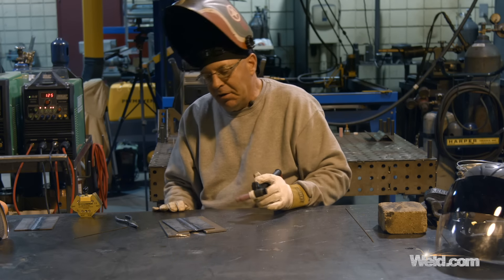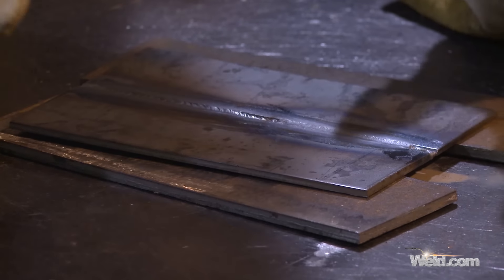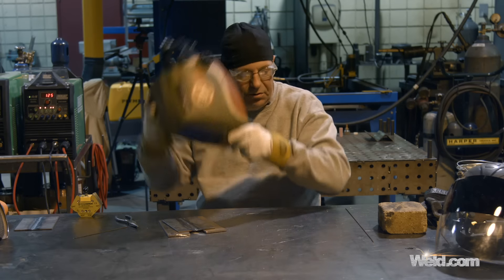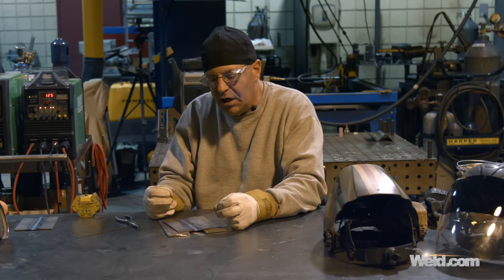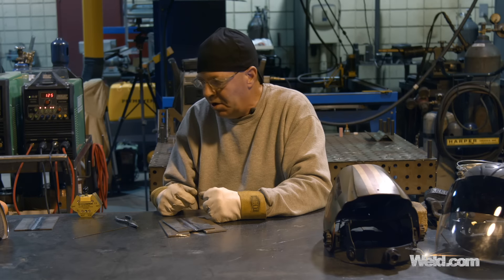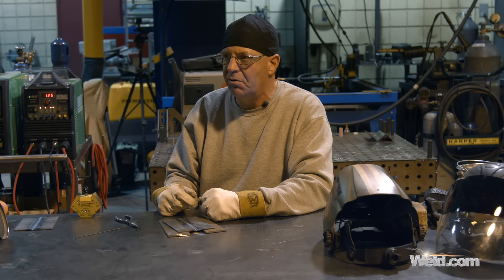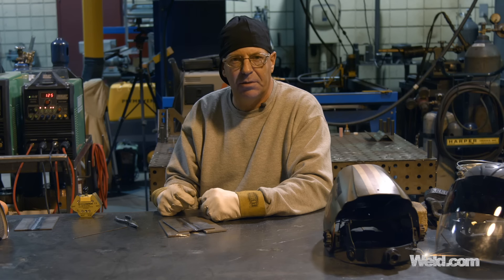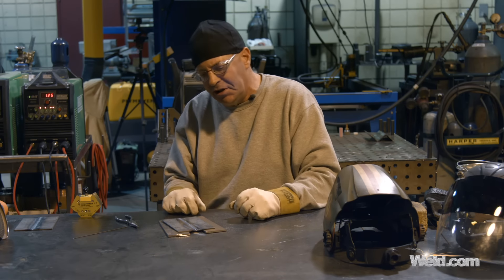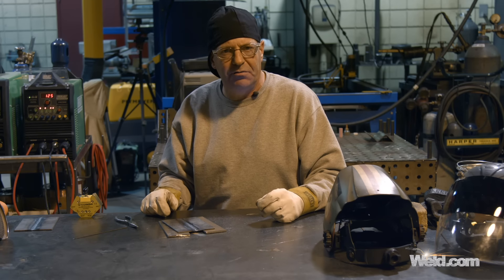Again, another little training exercise. I'm not going to get real critical about this — it's a little flat, but it allows me to practice into a thin groove. These exercises are meant to control arc length, filler wire, manipulate the tungsten at the right arc length, and get some flow. This is one I'm kind of challenged with — I need to go back and teach myself all over again. I hope this helps. If we can answer any questions and get you started on what to practice and how to practice, write us and we'll try to answer your questions. Thanks for watching — please subscribe.